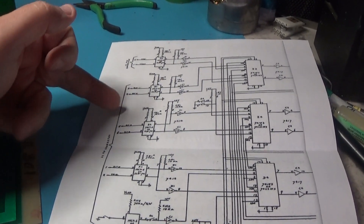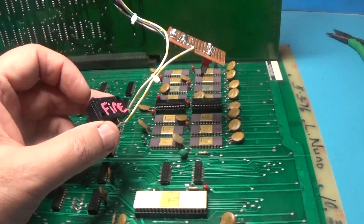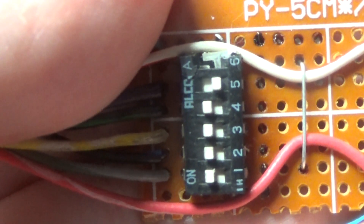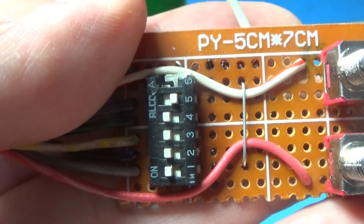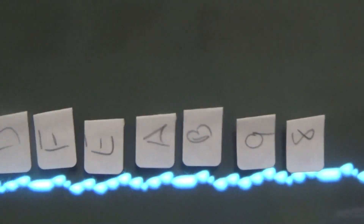You have your five-bit input on here. It's hard to read, but I think that's bit one, two, bit three, four, bit five, and trigger. The trigger is to fire the missile. So I have the trigger right here — fire. That's the trigger. This is coin, that's start, and then I have a five-bit DIP switch where I can set the five bits for the periscope position. I've put stickers on showing where these binary codes translate to where the torpedo is being fired.